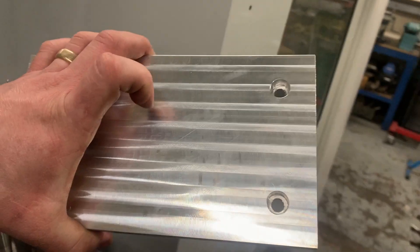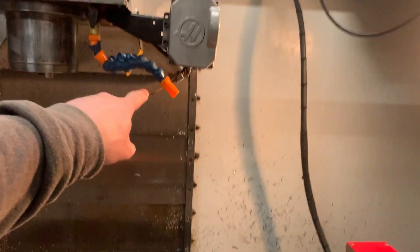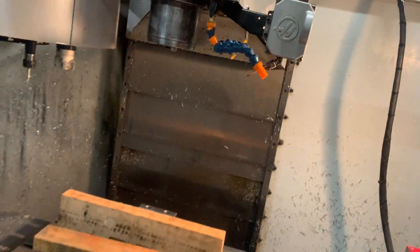Anyway, today drilling a few plates for some parts, had to put some holes in a bit of material. Randomly, I'm not sure what I'd done - I was just using the coolant out of the nozzle, not the P-cool, it wasn't spraying everywhere, the door glass was pretty clean - and I could have sworn I saw the tool move. So I turned the coolant off, looked at the next hole, and lo and behold the spindle itself is going up and down as the drill hits the material.